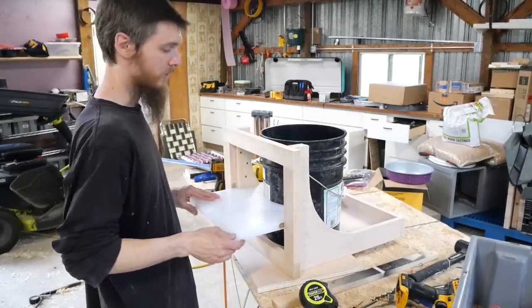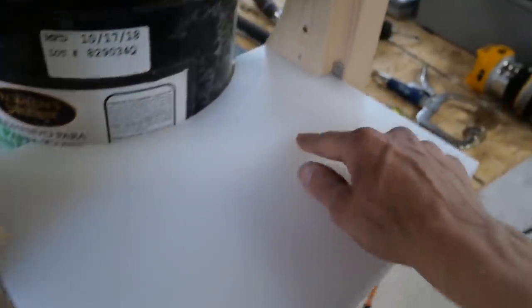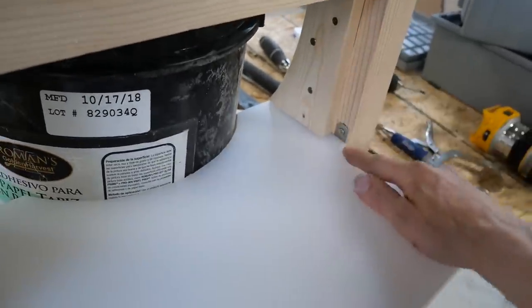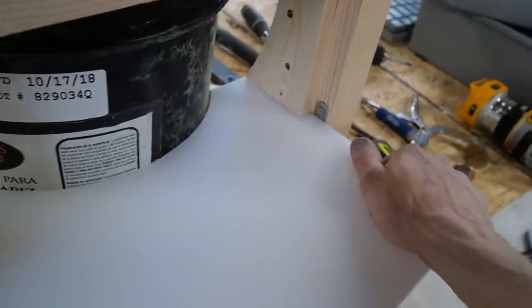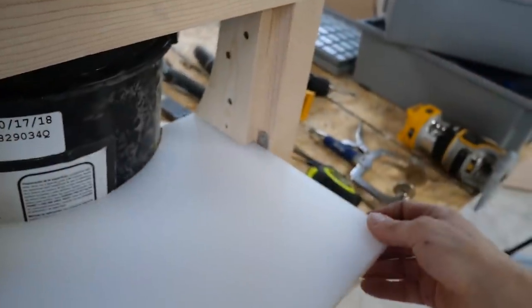We're gonna have to see if it works. I'm not sure how much weight it'll hold, but we got these swivel hinges, and then it swivels, it hits this wood stop. The end grain is gonna help not compress as easily and should hold its shape over time. And it should be able to hold a fair amount of weight. But we will see, we will see.